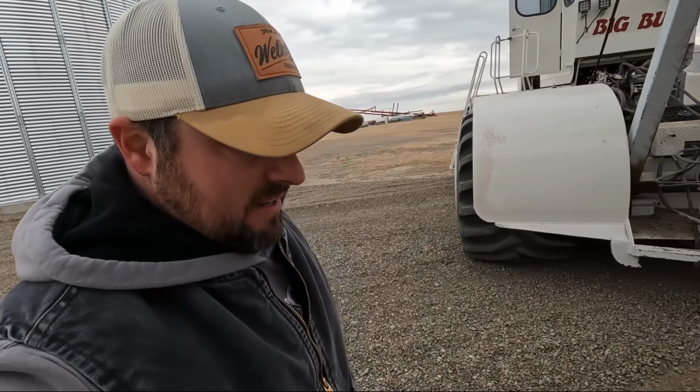Technically, we probably could get away with such a small bin this is, not putting stiffeners in, but if you put peas or any other kind of crop in it, what's gonna happen is it's gonna start putting pressure on it, and then it could curl the bottom ring and the bin could fall over, and just a bad day, so we don't wanna do that. If we add the stiffeners, we won't have a problem. We've done it before in a small bin like this, it'll work out fine, but we're doing a 20 gauge to an 18 gauge. All right, let's bring this out.